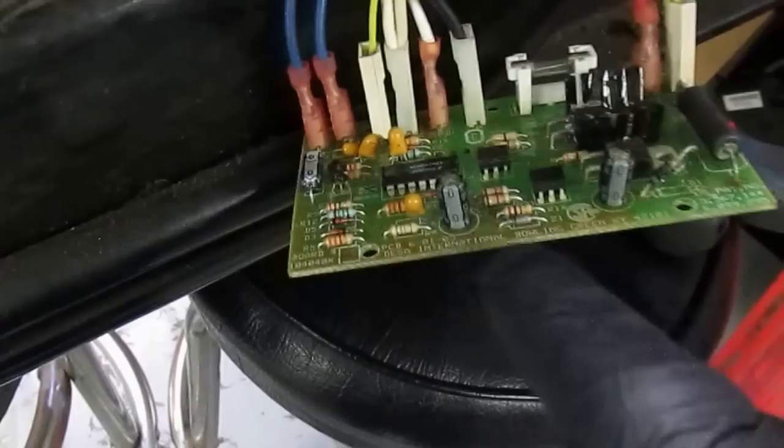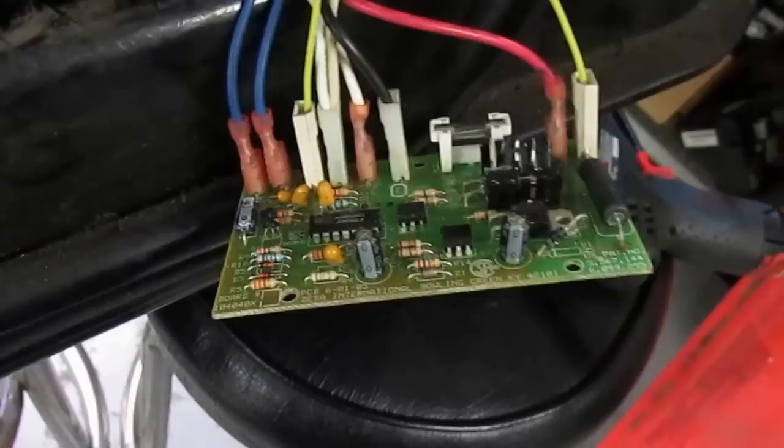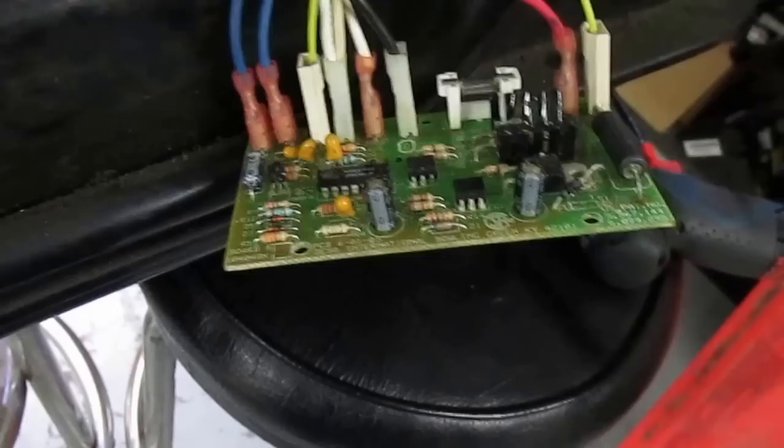There's a trick: you can use your own 12 volt DC supply as a troubleshooting method. What you need to do is connect the negative side to this black wire — make sure you use a 5 amp fuse in between just in case something goes wrong — and you disconnect this diode and use the positive supply here, connecting the positive wire to the zener diode. So you'll have a 12 volt DC supply, you test your circuit, and make sure it's working.